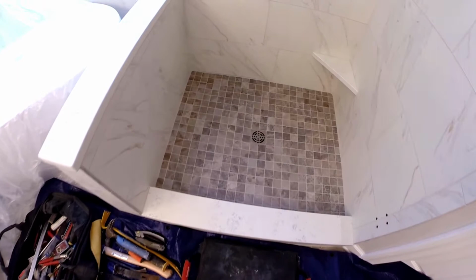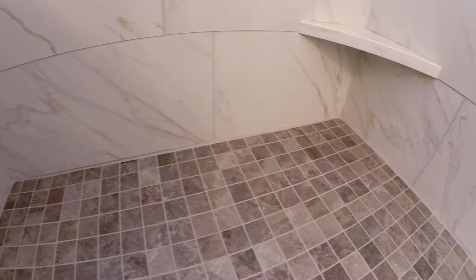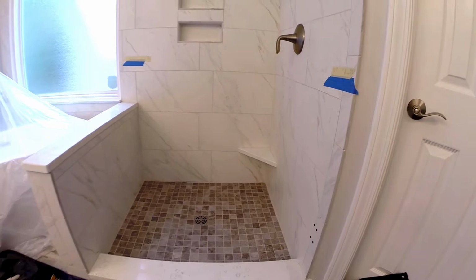Overall, the shower doesn't look that bad, except the wide gaps between the shower floor and walls, and every wall was installed with a slightly different pattern. One thing that worries me the most is that the entire bathroom was renovated in just 10 days. Usually contractors rush projects like that and they don't use the waterproofing membrane, or sometimes they don't even use the rubber liners. So you never know what you're dealing with till you take it apart and start from scratch.